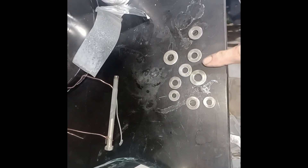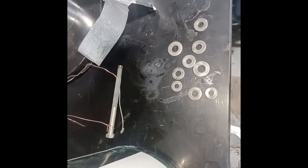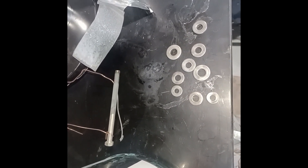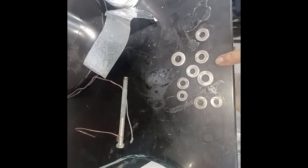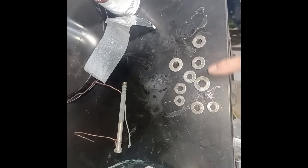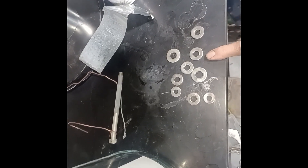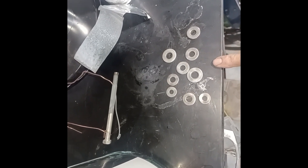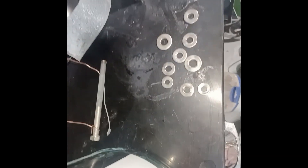Here are the washers off of the rear shocks on a CT70H — the blue-green one I'm working on right now. We're going to replate these with zinc. I did not put these through the sandblaster; I wire brushed them. You can do it either way — I normally blast stuff, but I just forgot to do these and it's a lot quicker for me to wire brush them.